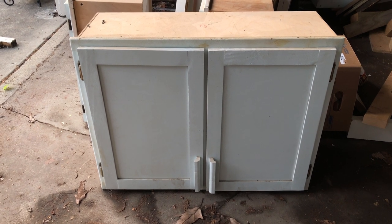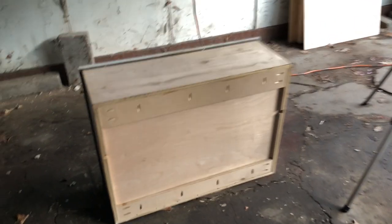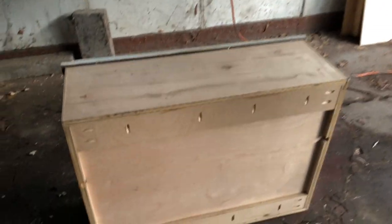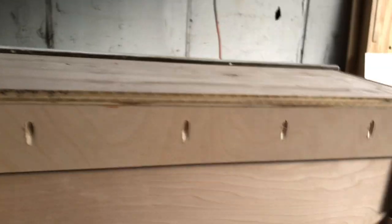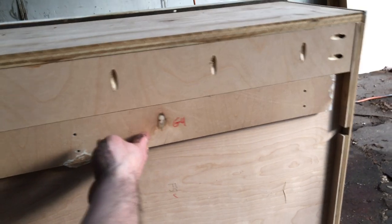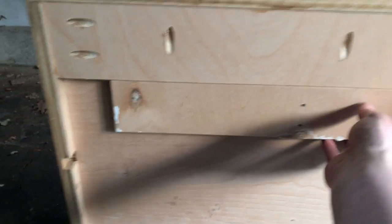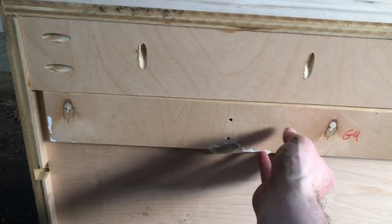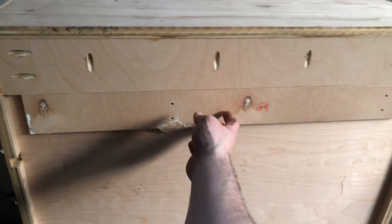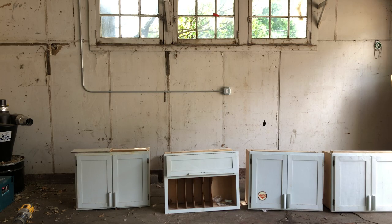These shop cabinets are the first cabinets I ever made. Patting myself on the back, I think I did a really good job on the actual cabinets. The face frames kind of stink, but the cabinets are great. And there's your French cleat. The matching one that goes on the wall is about two inches narrower than the width of the mating one on the cabinet — this means you don't have to be super precise and gives you some wiggle room when you hang up the actual cabinet.